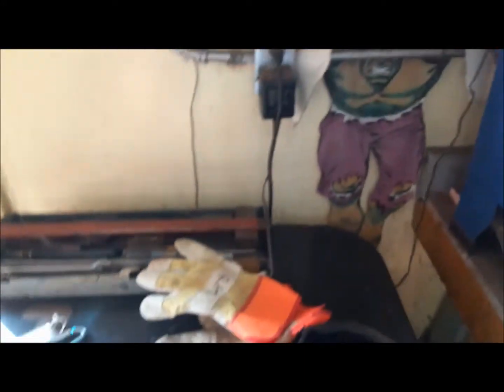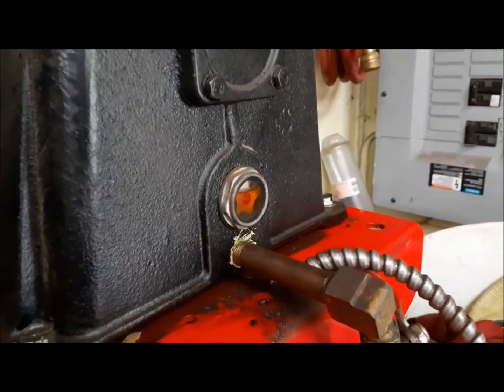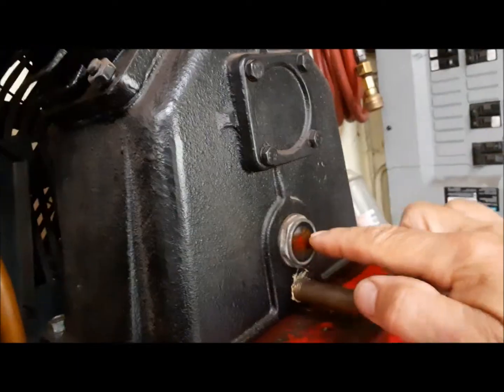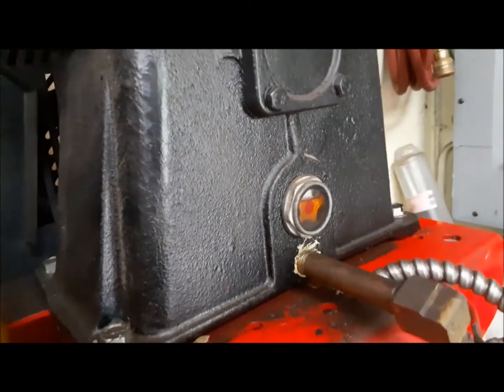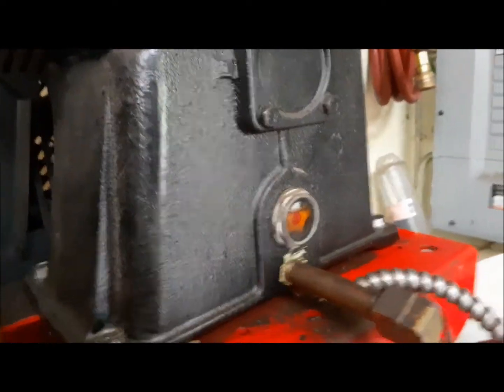There's that. There's our new filters. I also already serviced the oil. Sorry you won't get that on camera. But anyway, not much to it. Basically, I installed this a long time ago. You drain the oil out of there. You fill it in through there, into the sight glass. That's what you want to see. That's good. I've got it filled with 10W30 Mobil 1. It seems to like that. So we're just going to wait for the air to finish draining and we'll get to work.